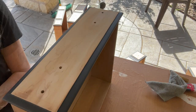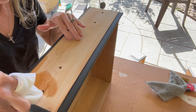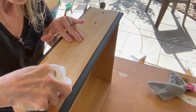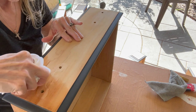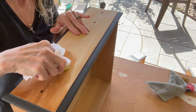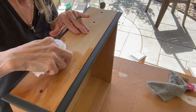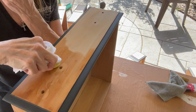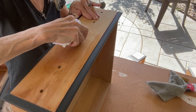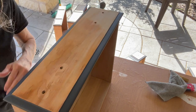Instead of stain, I'm using boiled linseed oil. What this does is it brings the beauty of the wood out — it darkens it up a little bit and pulls the grain up. You just rub it on — not too heavy — let it set for about 10 minutes, then wipe the excess off. I did one coat, let it sit overnight, and came back and did another layer. I can see where my handles were, but once I get my new handles on they won't show. Just go in a circular motion and make sure you get it completely sealed in.